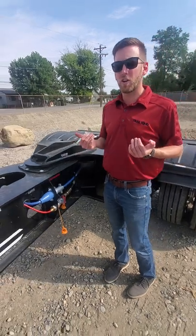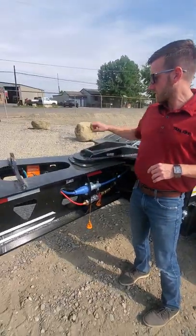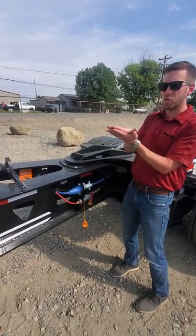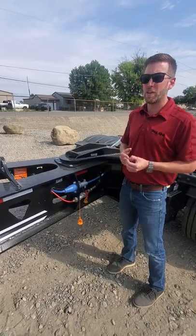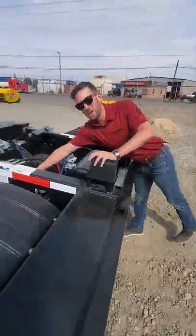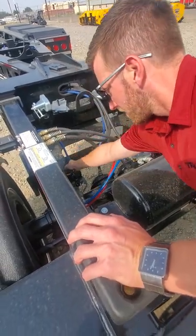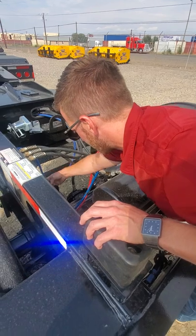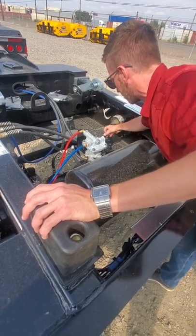In the event that you want to back the trailer up and maneuver, you can use the switch on the side here to pneumatically lock the pivot, and then you can disconnect the line to dump all the air in the booster — that'll make it so you can push the trailer backward without having to try to steer the trailer around. The flip axle is also equipped with chain-ups in the event that you load the booster onto the trailer. You can use these chain-ups, dump the bags, and pull those chain-ups to keep the suspension from dropping out as you maneuver it. When not in use, just go to the longest chain setting to keep the chains out of the way and not pull on your airbags.